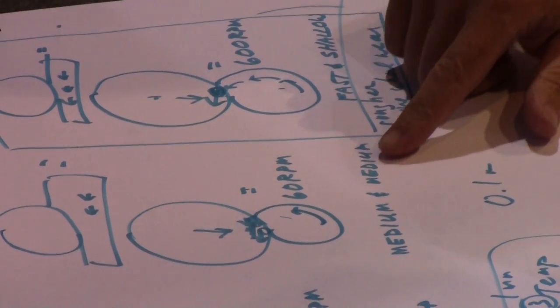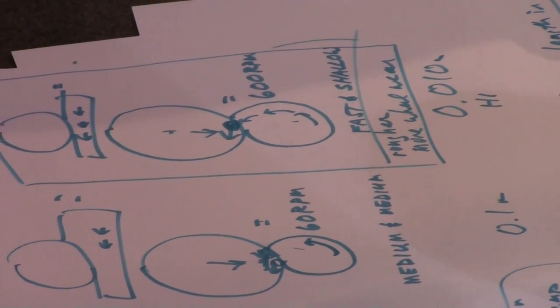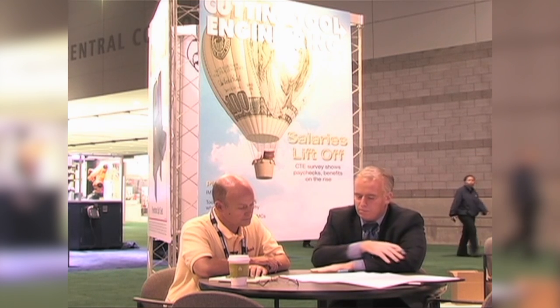So would you say I go from 60 to 600? That's kind of extreme. 90 or 120, something like that, to start out? Yeah, try 60 to 90, see what happens. Okay, go 60 to 100. Don't go 60 to 600. That was just for explanation. Moral of the story is speed things up, play around with it, see how fast you want to go. But in general, if you've got burn, you want to speed things up.